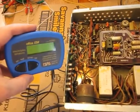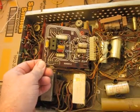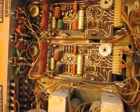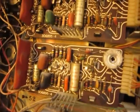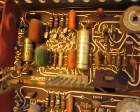I was going to go ahead and check them with my Atlas ESR checker, but it doesn't really matter because I'm going to be replacing them anyway. On top you've got the preamp board, and then below you've got your right and left boards. Everything looks pretty original — I don't see anything burnt, which is always a good sign. Hopefully it's just a matter of replacing capacitors and being good to go.